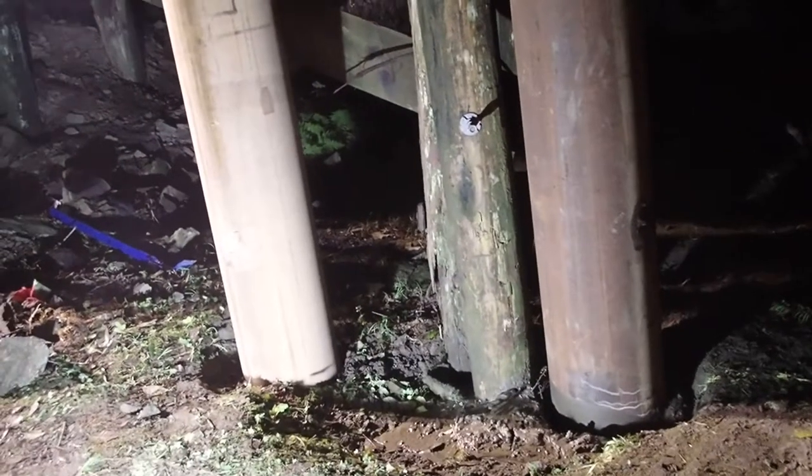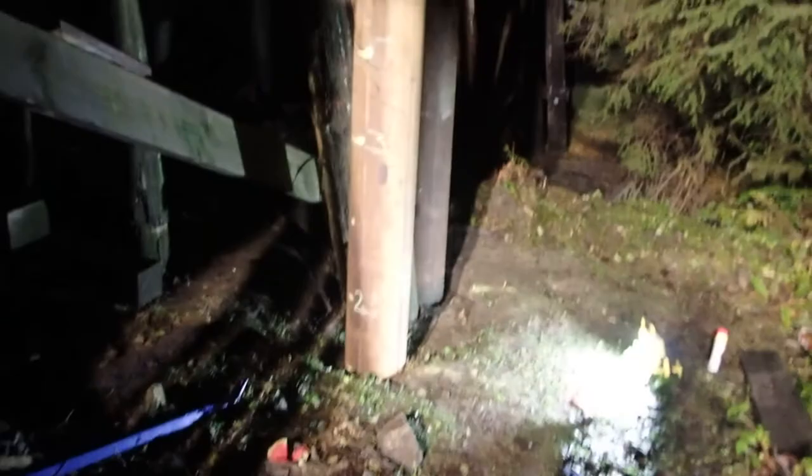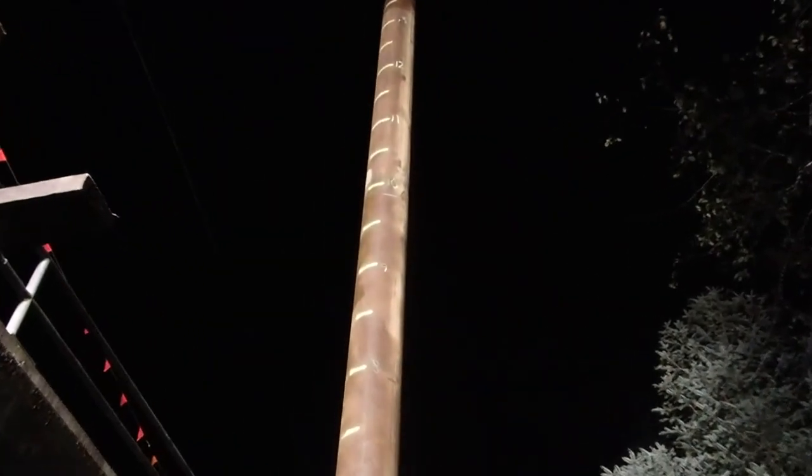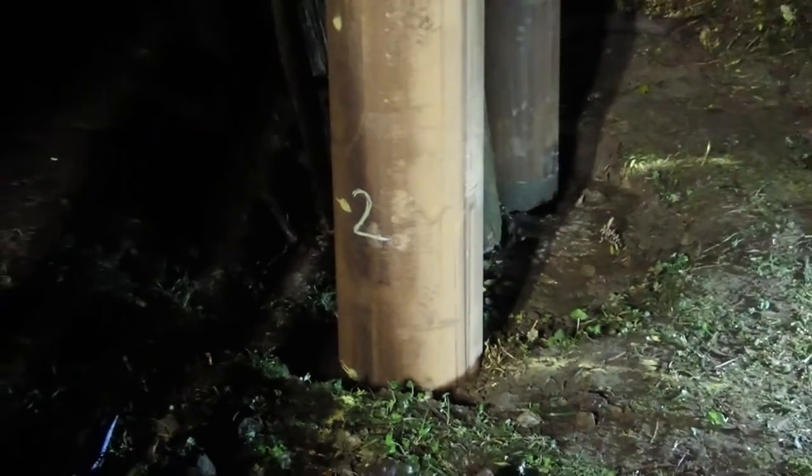So the two steel piles are embedded a meter and a half via the vibro hammer. And now we're switching to the kinetic drop hammer, which weighs 6,200 pounds, to drive the piles in the remaining depth. They've got to hit, at the very least, the 10 meter mark up there, for penetration. And so far they're in a meter and a half.